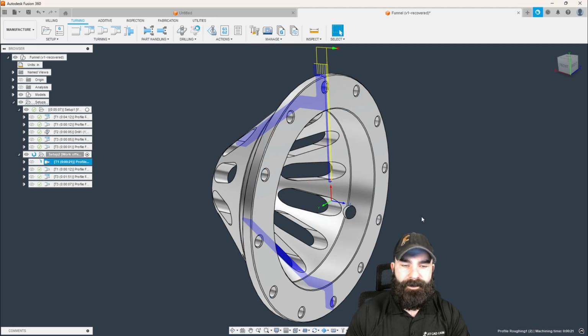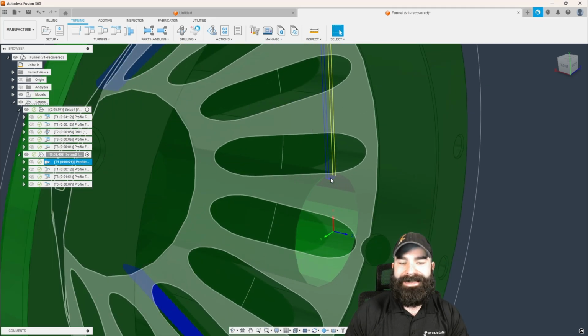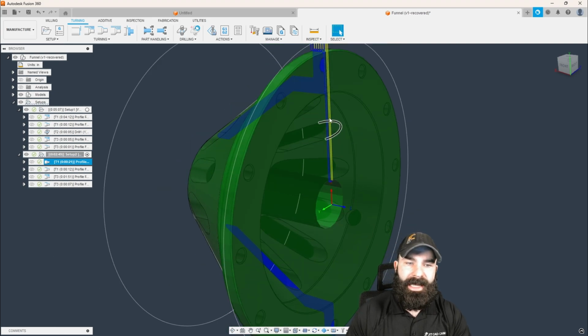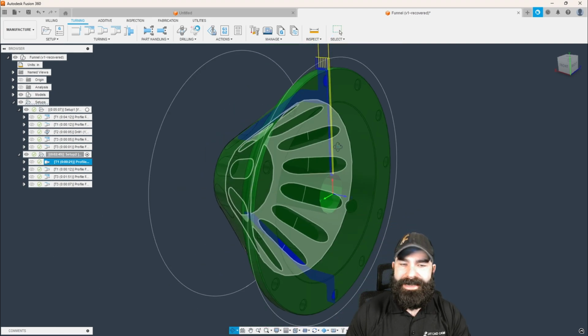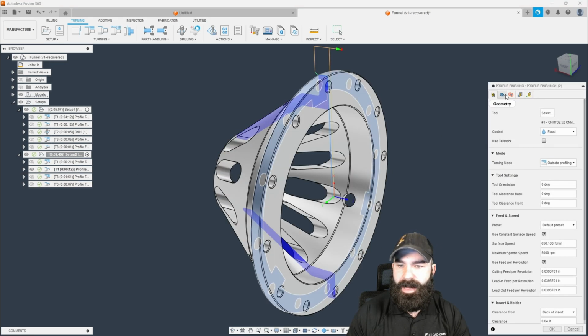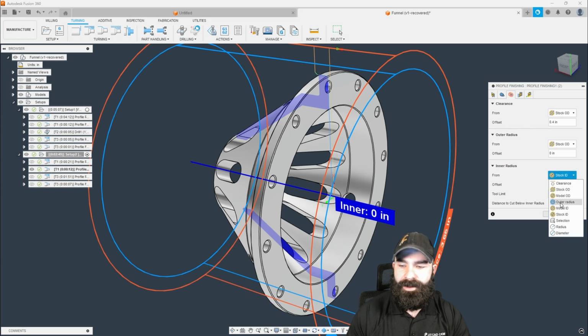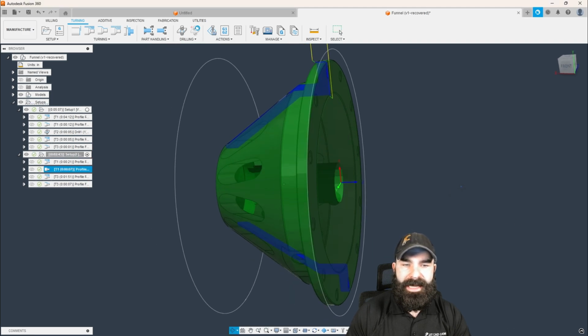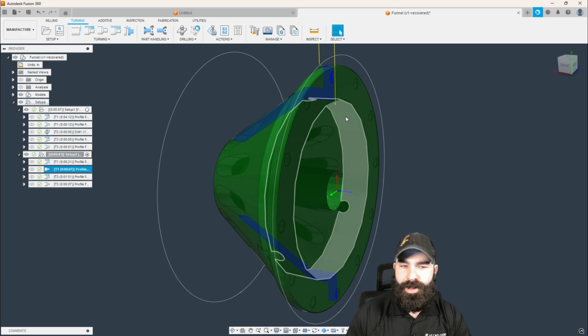That's 1 inch. And now you're going to notice that we actually stop that front roughing cycle short so that we're not wasting all that extra time. Given I'm also going to bore the inside of this, maybe I don't actually do that finish cycle all the way down. I'm going to stop my finish cycle at a selected profile, and that's just this inside radius here. And again, now we're cutting down our cycle time more and more.